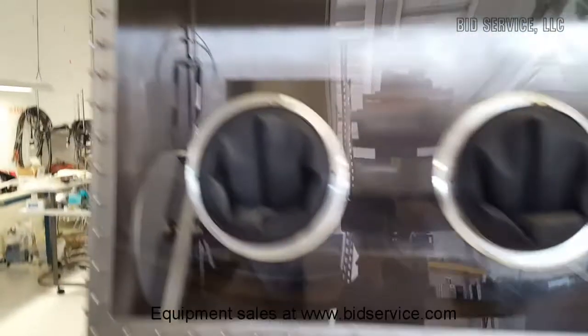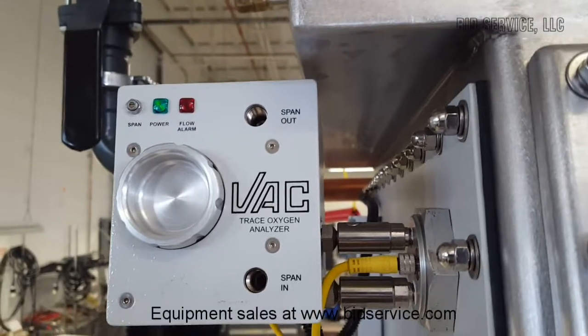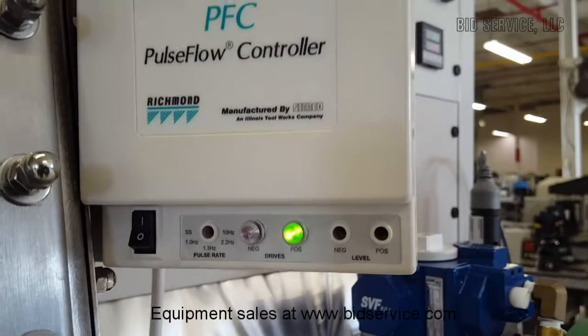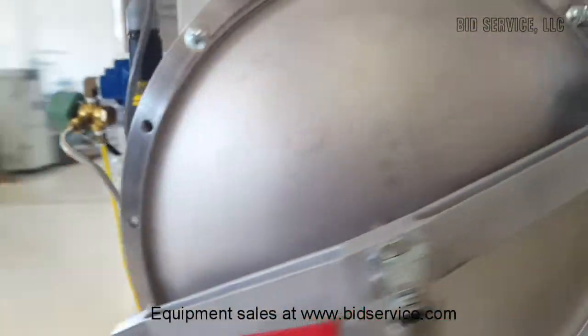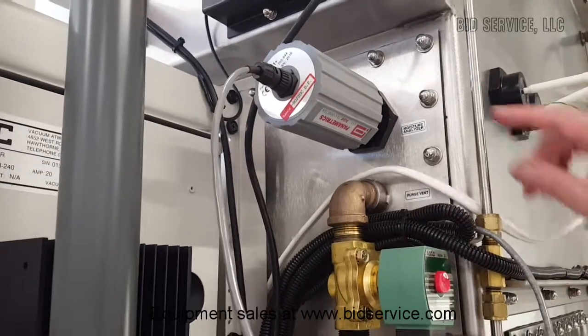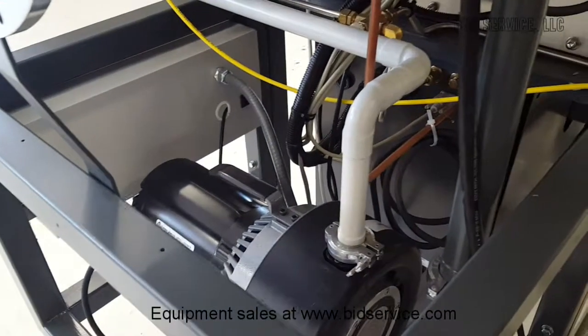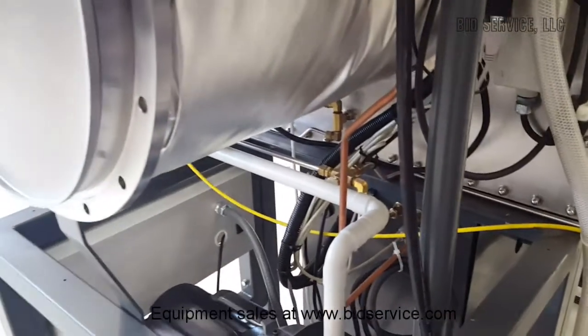Over here is our oxygen sensor. The cell for the oxygen sensor is new — we just replaced that. As we walk around this side I'll show you where the moisture sensor is. This is a static eliminator bar located inside the box. Coming around here you'll see this is our sensor for moisture — the AMX1 Plus. We also have a scroll pump here — this is your vacuum pump, it's a dry pump. It's used to bring pressure down inside the glove box, also used on regeneration, and to remove the atmosphere from the anti-chamber.